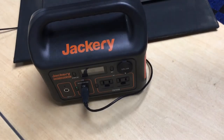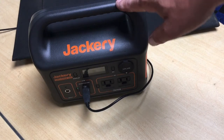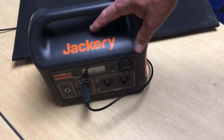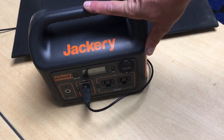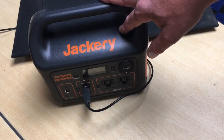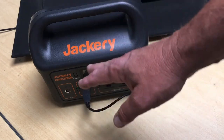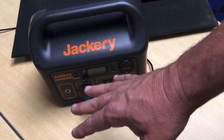We were out in the desert this weekend for an off-road race. 85 degrees, sunny, windy — gusts of 50 miles an hour — but unobstructed sun. I was moving the solar panel, following the sun around, and I was getting almost 50 watts out of this 60-watt panel. We were running everything — laptops, phones, LED lights at night, an electric blanket at night. My daughter was on her phone and laptop, maybe pulling anywhere from 7 to 15 amps. I would connect the solar panel and get an input of 49 to 51 watts, and it would charge up to 100%.